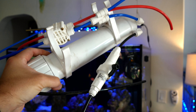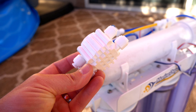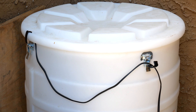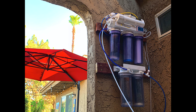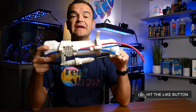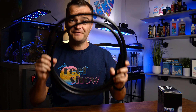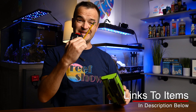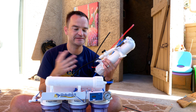All we're going to do in this video is take the Marine Depot Clean Water four-stage advanced RODI filter, upgrade to 200 gallons per day, add two additional DI resin containers, install the auto shutoff float valve kit, clean the shed, find the studs, drill the holes, attach the wood, mount the filter, install the auto shutoff valve, install the float valve, attach the uniseal, rinse the barrel, size and cut the tubing, and test the system — so we can go from a cluttered, unmounted 100-gallon-per-day RODI system to a clean mounted setup. You'll need: the MD Clean Water four-stage advanced RODI filter, the MD 200-gallon-per-day upgrade kit, the Spectra Pure Max Cap two-stage add-on kit, the Spectra Pure auto shutoff valve float kit, RO tubing and RO cutters, a half-inch uniseal bulkhead, a utility pump with flexible tubing and a plastic hose clamp, a stud finder, measuring tape, pencil, drill and drill bits, and whatever mounting hardware you'll need for your setup.